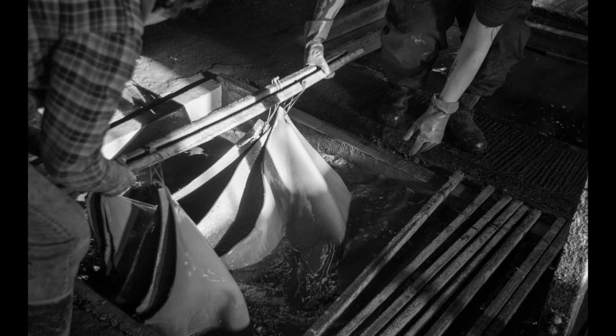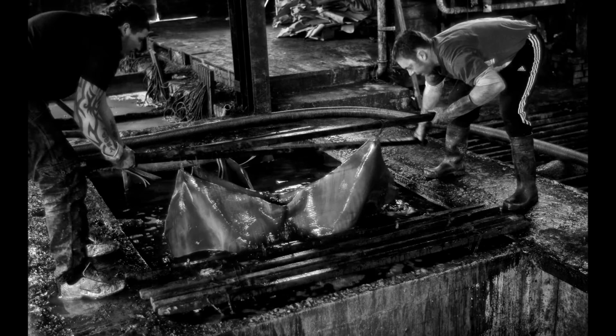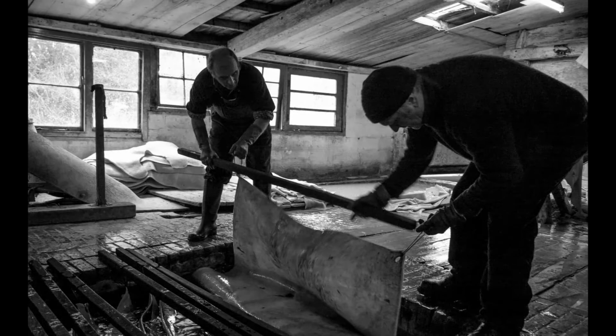They're suspended on sticks for the first 3 months, hanging down in the pit. That allows the tan to get all the way around them. That gives a nice even colour and a nice even tannage. But after 3 months we take them off the sticks and we're going to layer them so they get laid flat, one on top of the other, into deeper pits, and we throw handfuls of oak bark in between each one, so it's like an enormous sandwich.